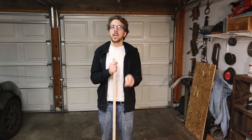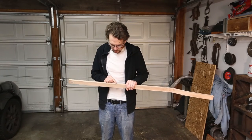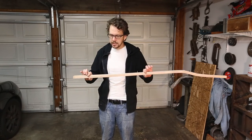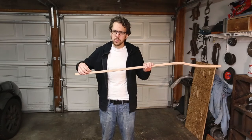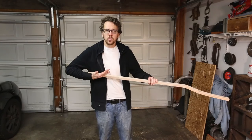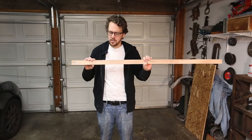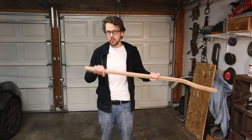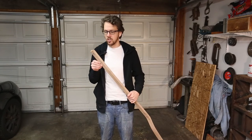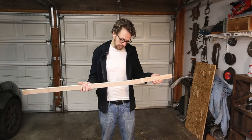You've got to hold the long side and compress the short side — squeeze it together — so that the outside of the bend doesn't stretch, because if it stretches, it breaks. The fourth thing: grain. You need fairly straight grain, and you need at least 15 inches on your bend where the grain is running straight and not running out of the board. If it runs out of the board before a 15-inch section, it's probably not going to bend. So I'm going to look at the boards more closely and find straight-grain sections to try and bend.